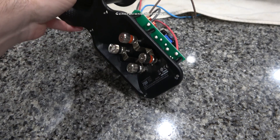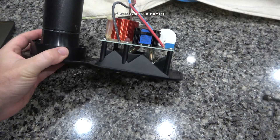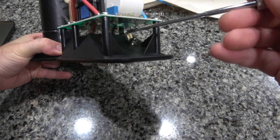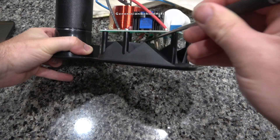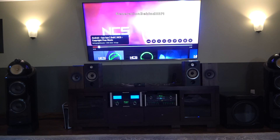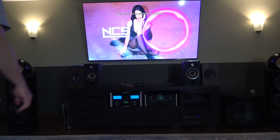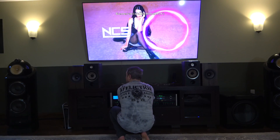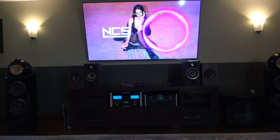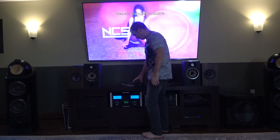Now it's time to test for ferromagnetic parts. Nothing on the binding post, nothing on the binding post plate. Most companies put steel screws or nuts on the binding post, but nice job B&W — nothing. No ferromagnetic parts. In my opinion it doesn't look like much has changed over at B&W: they're still building quality cabinets with quality drivers and crossover components. It's a shame my speakers arrived damaged because I was really looking forward to comparing them to the Focal Aria 906. If you own a pair of these speakers, please let me know how they sound in the comments below. So long and happy listening.